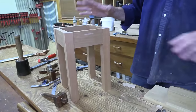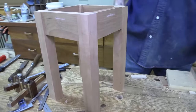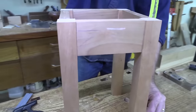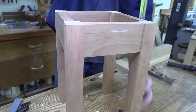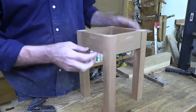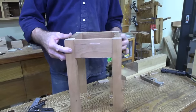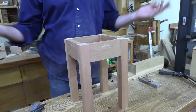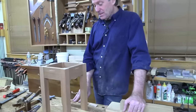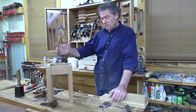Let's see if this works — hopefully they'll all fit. These are all hand cut, the exact same way. I've got to taper these legs. I think this will make a nice little what they used to call a whiskey table — a little table like this. This could all get glued up with the shoulders sitting up nicely, and you'd have the cutest little nothing table. You could knock out a table like this by hand practicing hand-cut mortise and tenons — do it in pine or hardwood and paint it. It was fun going one night without turning on the machines and just having some fun with hand tools.